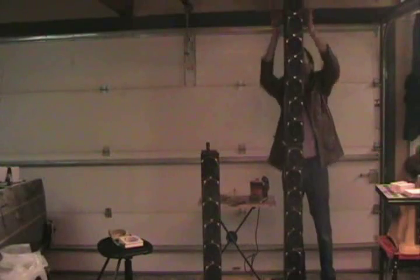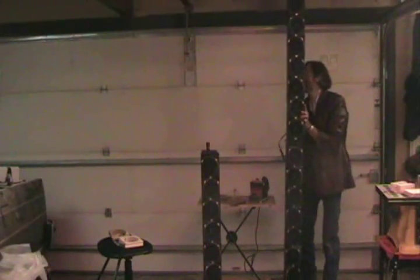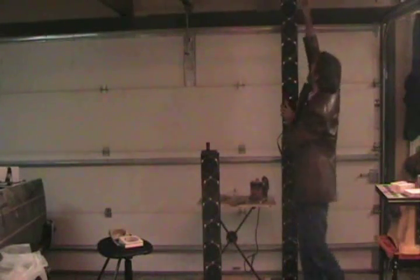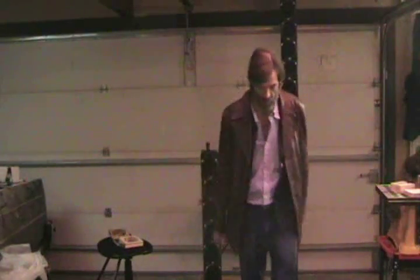I did it on an angle, and that slight angle is supposed to project the tweeter out this way and this way. A lot of audiophiles will say I'll now have combing. This is for PA. I'm not too worried about it. I just wanted the brightness back in the system. If I find out the piezos are too loud at high volume, I'll stick some foam in them to deaden them down a bit. So, it could use a cover, some kind of screen material, metal, if I was going to go fancy.